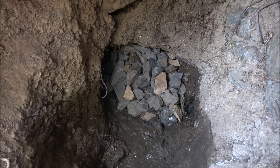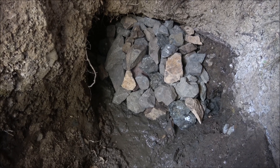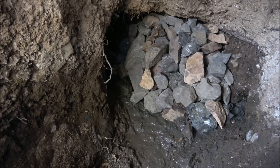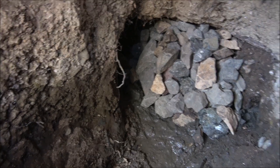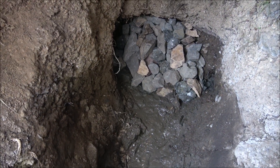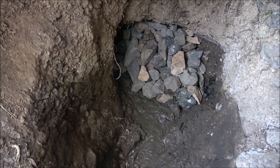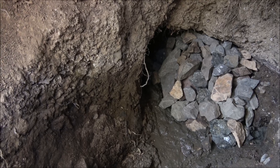The guys have been rocking this in and they've got it almost full of rock. You can see the rock fills in the back, roof to in front of the dam. We're going to fill in that cavity to the left to get rid of it — fill it up with rocks. Then we're going to put a piece of plastic over that and at least six inches of dirt on top. That may not happen today; we just want to get this rock in.